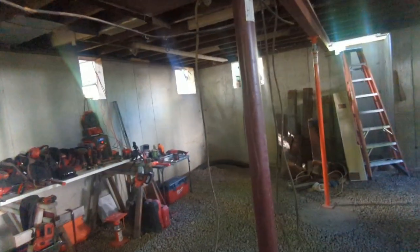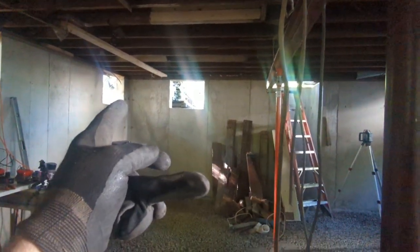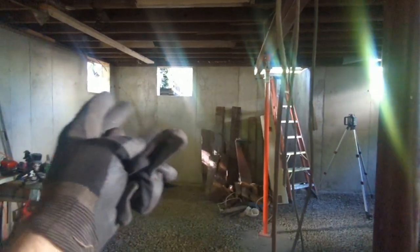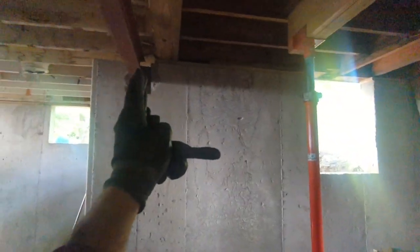So there was that. But then out of curiosity, I wanted to check and see that the beam is straight, because if I want to straighten this beam, I mean, he may wiggle down the course here, because we only just got things in here enough for Sean to get out of here. They haven't been dialed. So I took a measurement from the outside walls. This is a shorter span, and I'm by myself, so I could hang the tape out more reliably this way. So I did from the flange to the concrete wall there, flange to the concrete wall over here, and this is an inch greater, and so I may want to bring that over an inch when we get everything all dialed up in here.